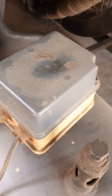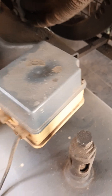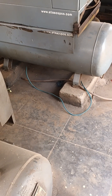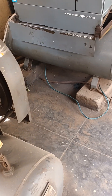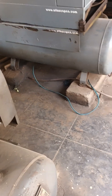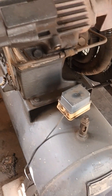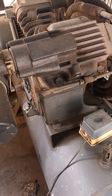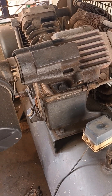Here there is a 230 volt supply and there are NO/NC connections. And this is the safety valve. For example, the receiver tank maximum final pressure is 17 bar — that is the pressure the receiver tank can withstand. For safety purpose they have mentioned 17 bar pressure. But for this compressor, working pressure is 10 bar. So if more than 10 bar pressure is building from the compressor, then automatically the safety valve will blow.